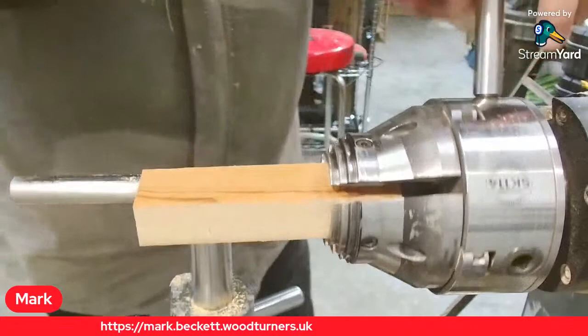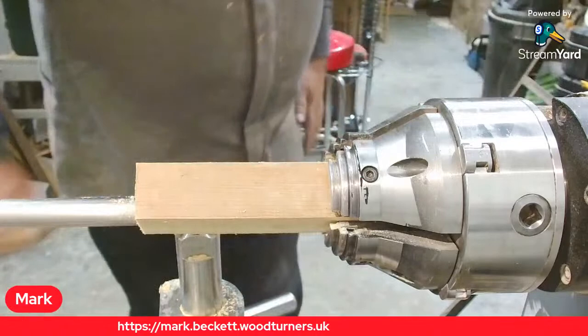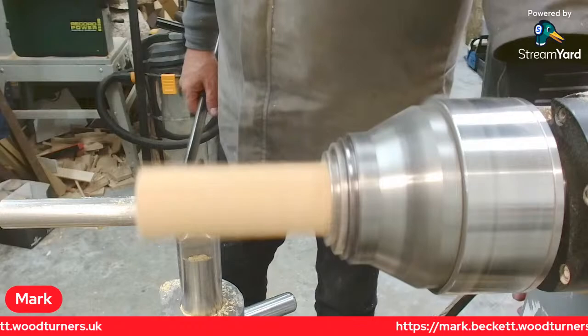Gav Sade Woodworks just joined us. He said, evening. Question, what is everyone's preferred bevel angle for the skew? I assume I'll get some different answers. My preference is 20 degrees. That means it's 10 degrees each side. The whole angle is 20, yeah? No, 40 degrees included. Oh, 40 degrees included. Sorry, right. Okay. 40, yep. 40, 20 degrees each side.